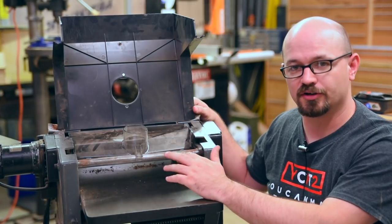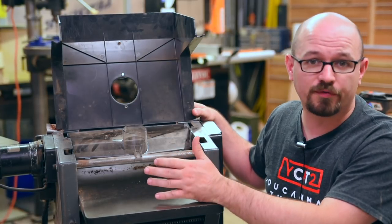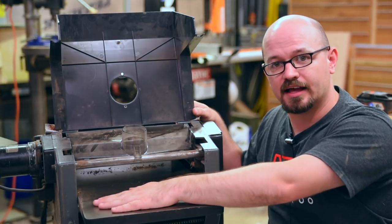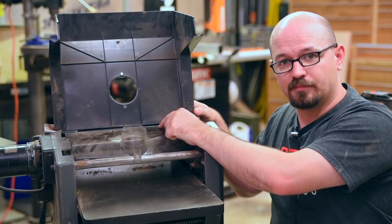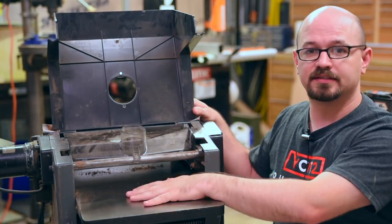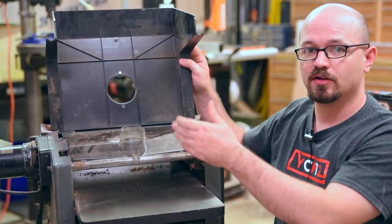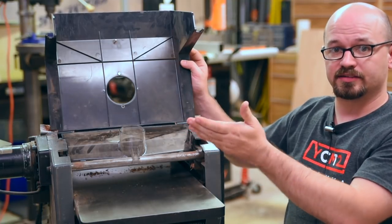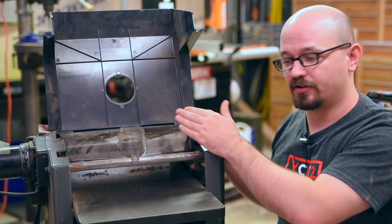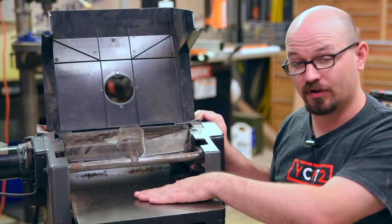The jointer and the planer are kind of brothers — they work in a very similar fashion. So if you're familiar with the jointer, this isn't too different, or if you've seen my jointer substitution video. The planer has a bed or table, and above that, behind this dust collection guard, is a rotary cutter head that rotates towards the infeed side. This is actually the outfeed side — the infeed side is over here. You pass your board through the planer, and the rotary cutter head cuts the top of the board. Your good side should be referenced off the bed, and then the rotary cutter head will make the top identical to whatever side goes on the reference bed.